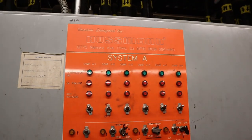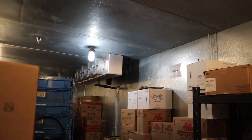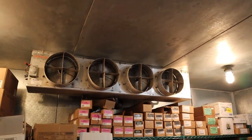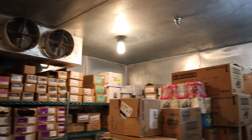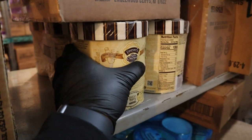The last one is rack A, which is the low temp. Anything frozen is going to go to the low temp rack. Here it's a minus 22 for this store and it's running good. So anything — grocery freezer box, dairy freezer, bakery freezer, reach-in, ice cream — anything frozen comes here. This is a grocery freezer box — beautiful room. Got to check that product; product tells the story, product tells you everything. So we're running good.